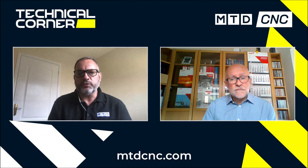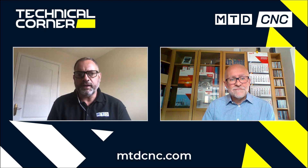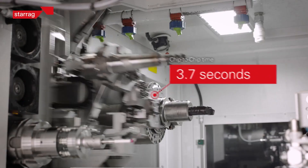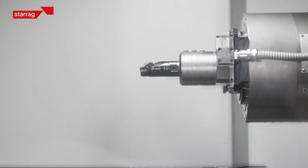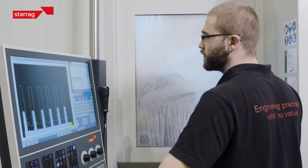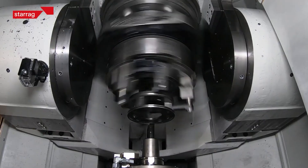That's incredible — using automation to deliver that kind of saving. How do you quantify it? You need to break the savings down. In this particular case, the target was 40,000 parts per year. We calculated we needed 52% less floor space, and the productivity gain per meter was a factor of 2.6. We also reduced tooling cost by 30%, which is a significant ongoing saving for the customer, and we reduced fixture cost by 50%.